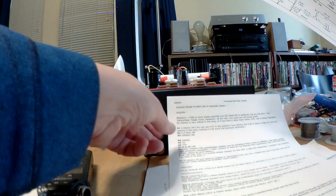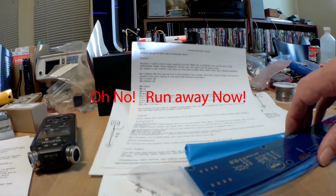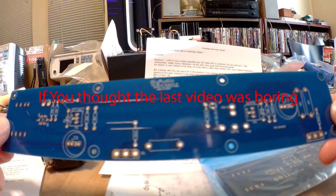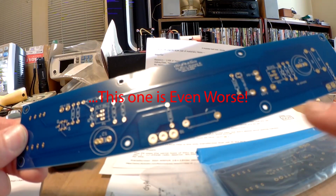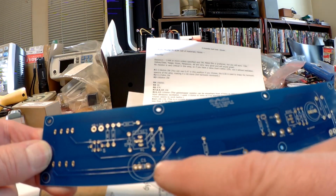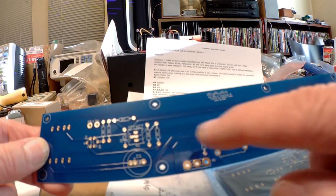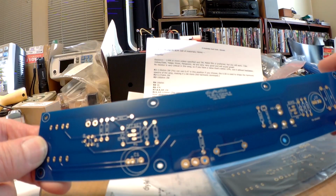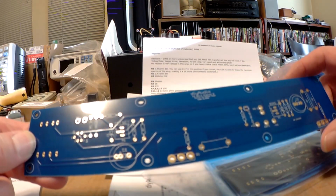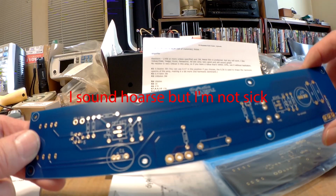What I wanted to do is start stuffing a board. Nudge this down a bit, that will go. Here's one of the circuit boards, and they're very simple. There are two MOSFETs per channel, input FETs, the transformer sits here. You have a pair of offset bias pots. Oh, this one does say offset, but they're both bias pots actually. Although, if you watch my F5 biasing technique, you know why they call one bias pot an offset pot, kind of how they work in a way.